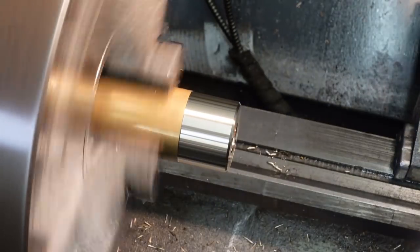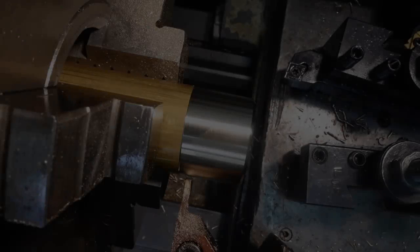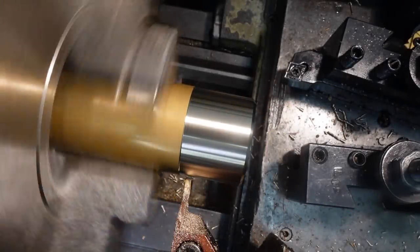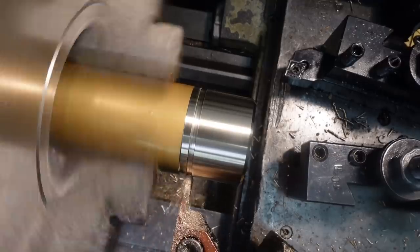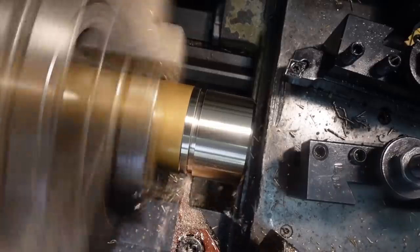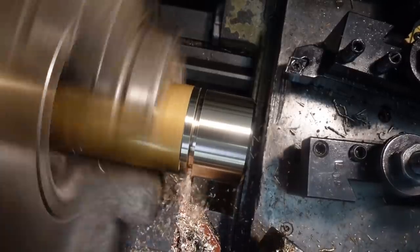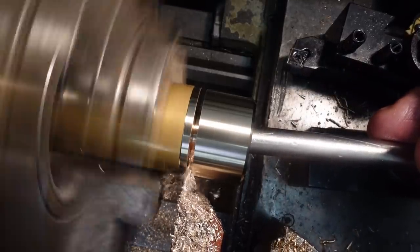I'll be doing further machining operations on the other face to make the jaw teeth, so I don't need to do any special cleanup of the parted surface. I'm measuring the position of the parting tool using the DRO. Off camera, I did the usual with a straight edge across the part, adjusting the parting tool Y position so it just catches the edge of the ruler and clicks, and then zeroing the DRO and moving in the required distance.